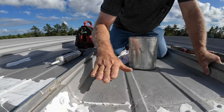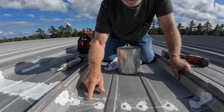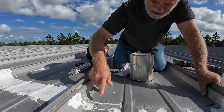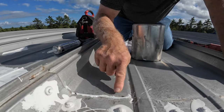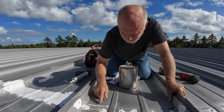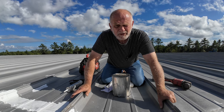These two panels expand and contract, and that quarter of an inch contact will break loose right there — within a month, it will break loose. When it breaks loose, it breaks loose from the top, not at the bottom. Now you've created a wall that prevents the water from flowing over, and it forces the water further back into the two seams. Absolutely fatal. You cannot do that.